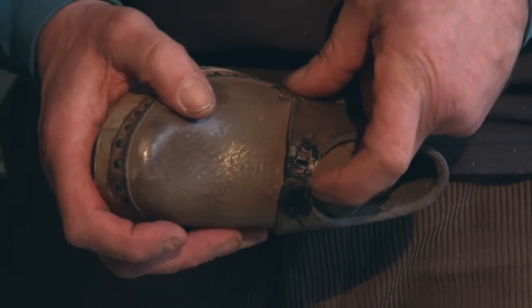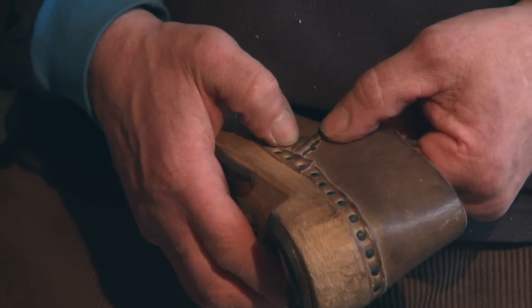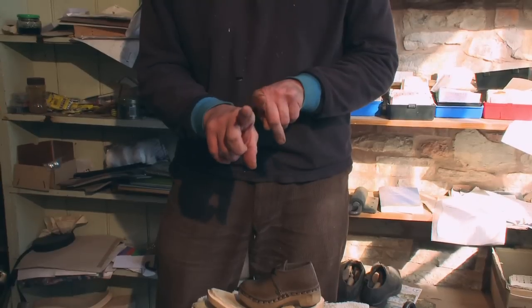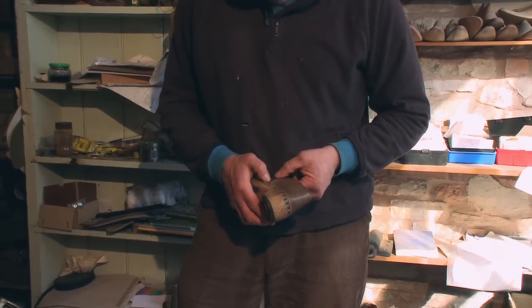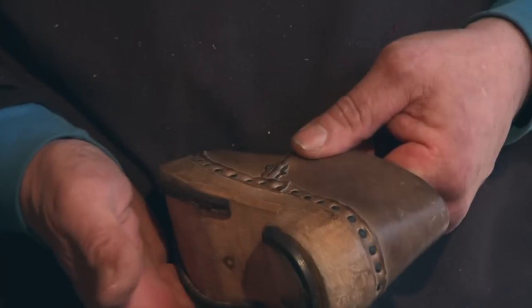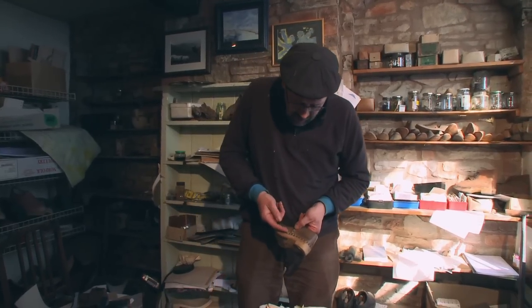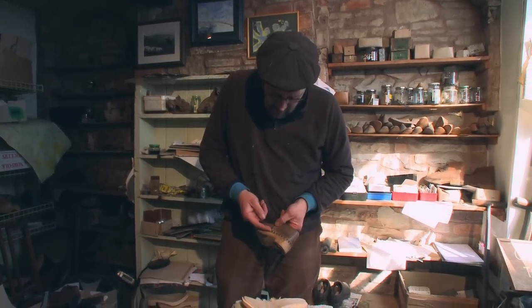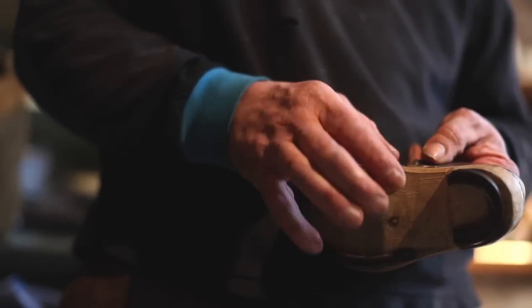It could be neater, but it is tough. Basically what you do is you get five or six strands of cotton and you taper them — you start one there, the next one there, next one there, next one there. Then you twist them and rub them in a heavy wax. They used to have different waxes for different temperatures — in the winter they'd use a softer wax than in the summer. What you do is you go through at the bottom with a curved needle, like a surgeon's needle, and you twist it through and up, but you don't go right through the leather — you go through the edge, so it's quite gory.